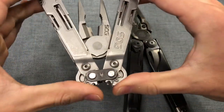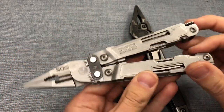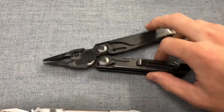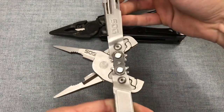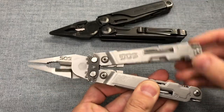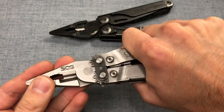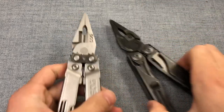You can see we have this geared mechanism on the SOG. This is common to all of the SOG tools. It adds compound leverage — this gearing mechanism gives you only half the splay of your handle splay. The jaws move in the same manner as the back of the handles. When I get way out here, my jaws are wide open but my handles are splayed super far. So you have a two-to-one ratio of handle splay to jaw splay, giving you twice the cutting power. If you're putting 40 pounds of grip force on the handles you will get 80 pounds of bite force on your cutters.